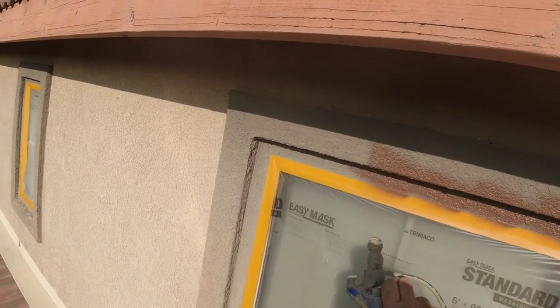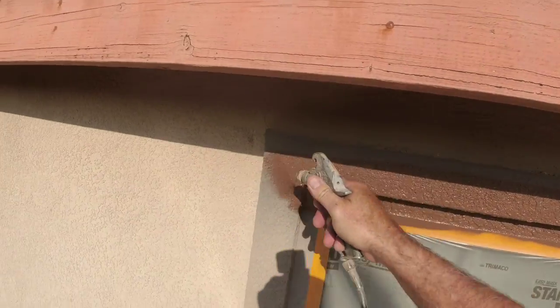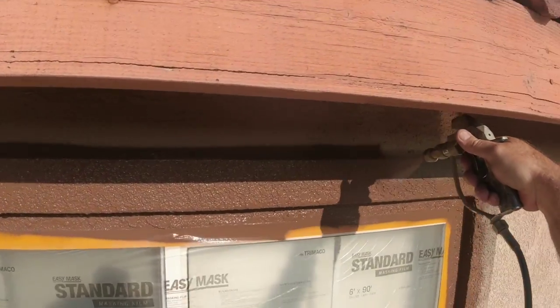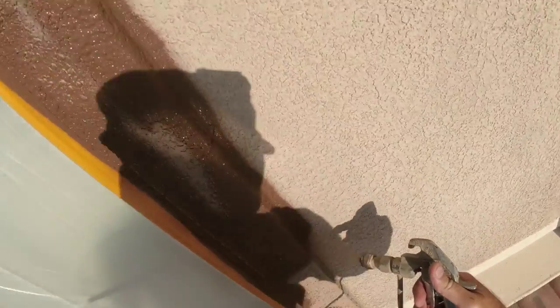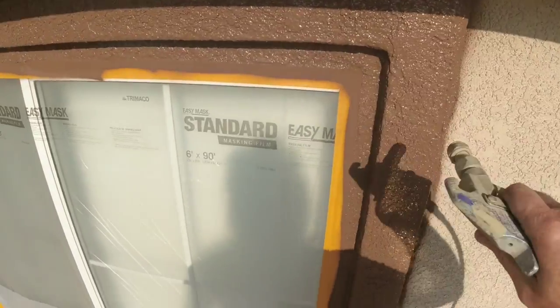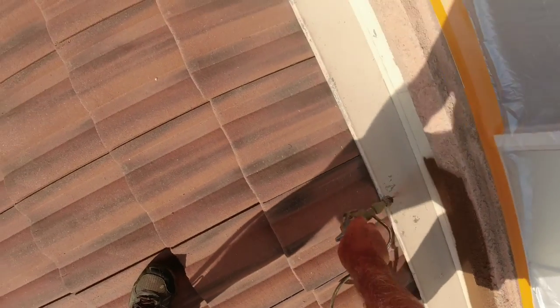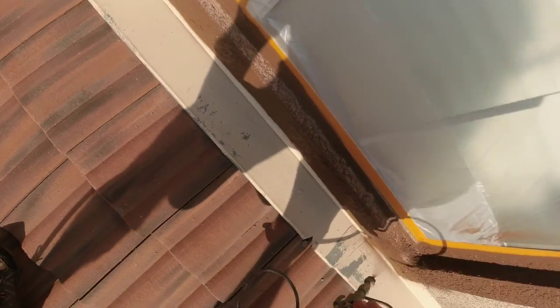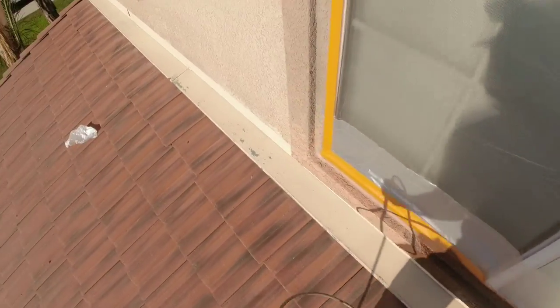So anyway, just going through here, cross spraying a little bit. I know I'm going to have some stucco shadow misses. It's really easy to fix if you've got it pretty well covered. You just go through with the brush, with the paint thinned down a little bit, and whip it around in the corners and take the brush and push it in the cracks. Have the paint nice and thin so it flows right into the edges. That's what I'm doing later in the video.